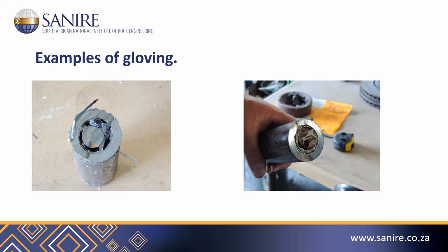Finger gloving occurs when either or both the catalyst or resin compartment of a resin capsule have not been pierced by the roof bolt on installation. When this happens, the catalyst and the resin mastic cannot be mixed, no chemical reaction will take place, and the resin will not set. Below are examples of finger gloving. If one looks at the example on the left, one can clearly see the resin mastic is still wet. No catalyst has been mixed with this resin mastic, and setting of the resin has not occurred.